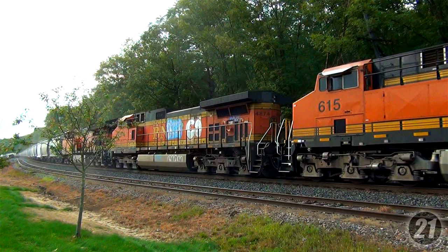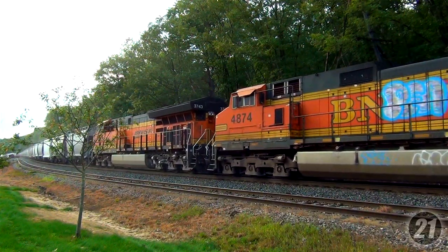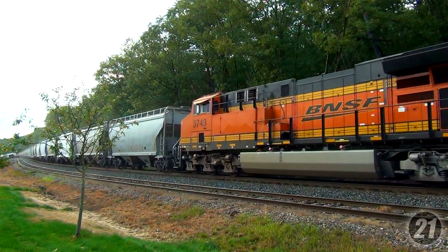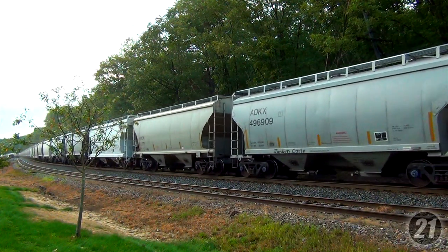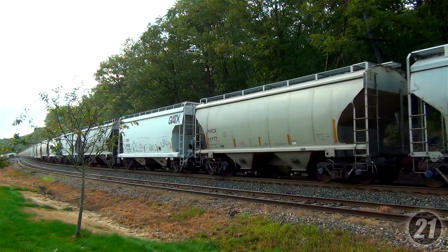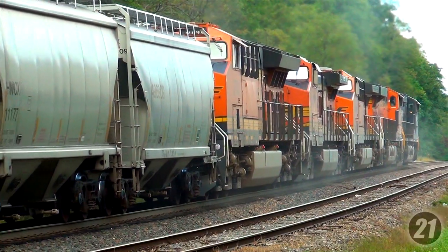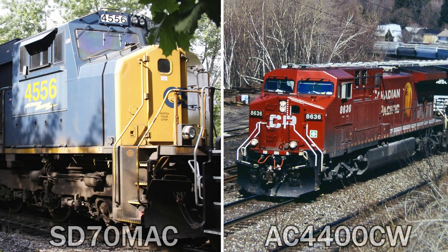Well, not exactly. One could argue that the starting and continuous tractive efforts listed are strictly electrical ratings for the motors. It's said that the GEs simply have more robust motors than EMD locomotives, giving GE a slight advantage. An important side effect of this is that with one traction motor cut out, the GEs can still produce full horsepower. That means that they can continue on with their trip without any time loss, assuming that there isn't a ruling grade that requires the tractive effort provided by the missing axle.